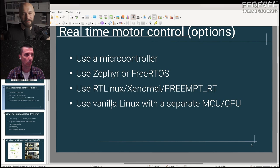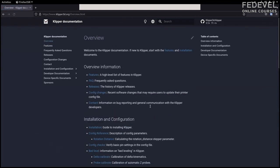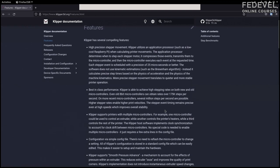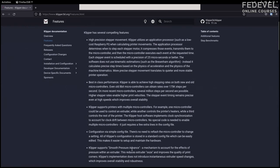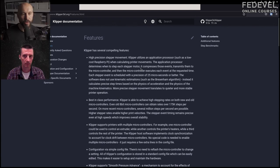The concept is that you have a single-board computer plus something else that handles the real time — for instance, a Raspberry Pi with an Arduino-based microcontroller. You do all the calculations on the fast single-board computer, then send the low-level stuff to the hard real-time microcontroller.